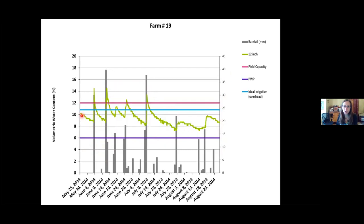So it starts off, and you can see each day that at night the soil moisture is flat, and then during the day it steps down. So you get those nice stair steps, which is what we want to see. And when it rains, you can see the soil moisture goes up. So this is soil moisture instruments working well at this particular site. Because it's a sandy, gravelly soil, we get a really big draining effect right after those big rainfalls.